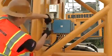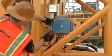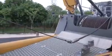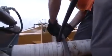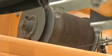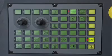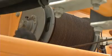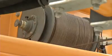Remove the bypass plug on the boom head and connect the electric cable between boom head and jib foot. With the help of the rope reaving winch, the hoist rope of drum 1 is led to the boom head and attached to the sling of the luffing A-frame 2 using the rope socket. The rope reaving winch hoisting function is controlled from the right control panel X11 in the cabin. The cylinder function must be pre-selected for this purpose. For unwinding the reaving rope, the freewheeling function can be activated via the winch clutch.